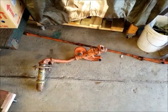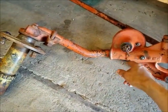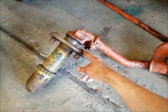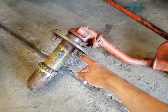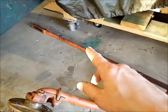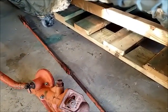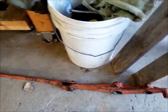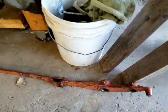Got a little bit more done here. Got all the hardware for the pivot — the bolt and castle nut all cleaned up, threads chased. All the studs for the rear tail wheel carriage bolts, threads all chased, nuts all chased, so all that's clean and ready to go. Got this linkage here, took that apart, straightened it all out, chased those threads, cleaned them all up. Also took apart the greasers, cleaned those out — all ready to go.